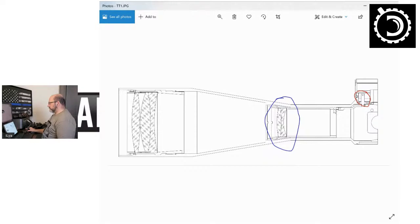There is a tube that they're in. The tail end of the tube close to the turret has a little lever that comes out, and there is a pin that is engaged by the parallax turret, and as you rotate the parallax turret, the pin is moved back or front, okay? And the lenses in the parallax cell and the focus cell move back or front and adjust the image focus and parallax, okay?